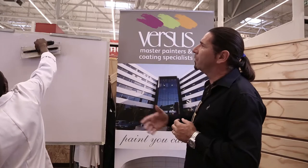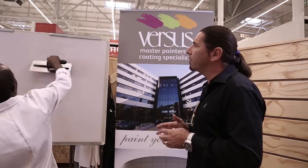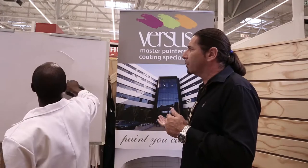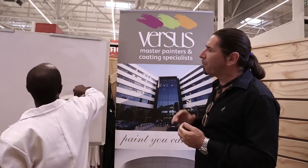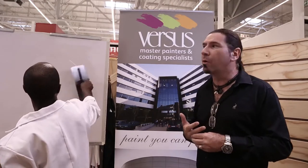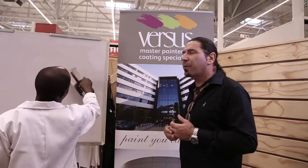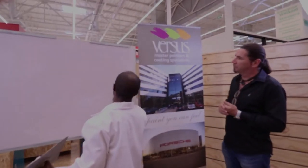As you can see, all Zeb is doing is trying to cover the wall, or the board in this case, making sure that he covers every little piece of wall. He's applying it very thinly, because even if he hasn't covered it on the first coat or second coat, on his third coat he will have covered it. If you apply it very thick, you're going to have to sand it down a lot more, and it makes a lot more work. It doesn't make it look better if you apply it thickly. The product, incidentally, might start cracking if you apply it too thick. Okay.